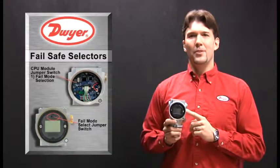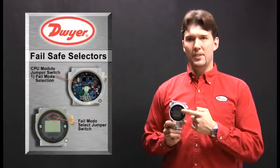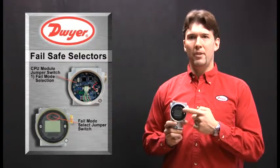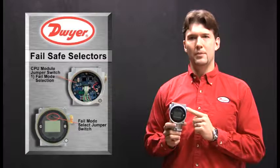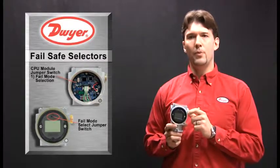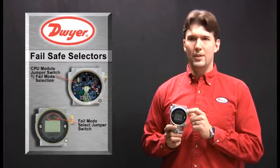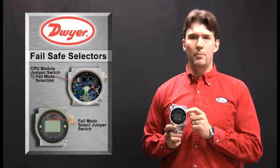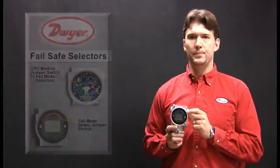The 3100 and 3200 both offer a fail high or fail low feature. If set in the fail high, in the event of a failure, the transmitter will output 21.75 milliamps. If set in a fail low, the transmitter will output 3.75 milliamps in the event of a failure. Under normal operating conditions, the transmitter will never output 3.75 or 21.75 milliamps.